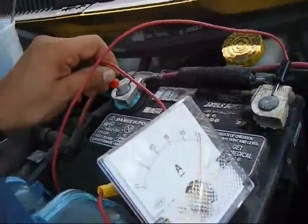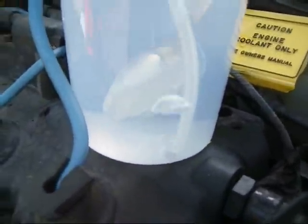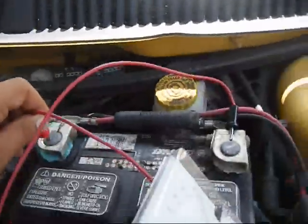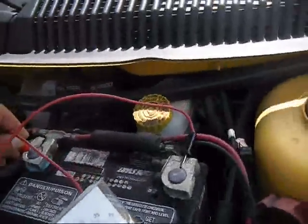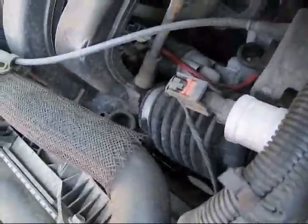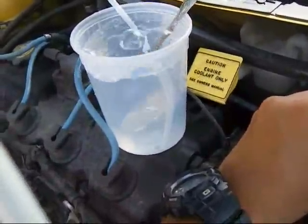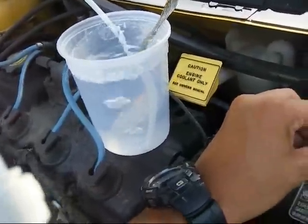So that's pegged but hovering right around 25. And I've got about twice as much gas production. That's due to the fact that it's subjecting each of these cells to 25 amperes and not each to 12 amperes. And as we all know, amperes makes the gas. This is overwhelming the 14 gauge wire — 10 gauge wire is alright. This is right around 25 amperes, which is what I wanted it to run at — about 6 volts per cell. And I've got good production.